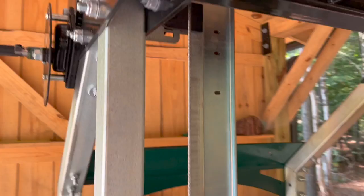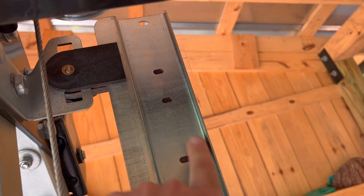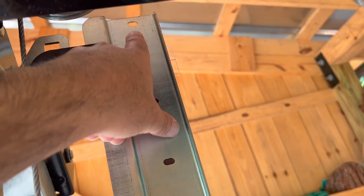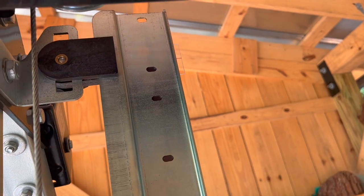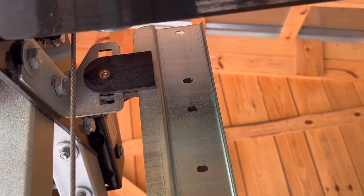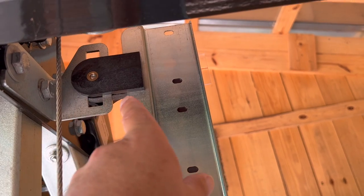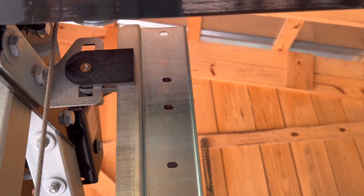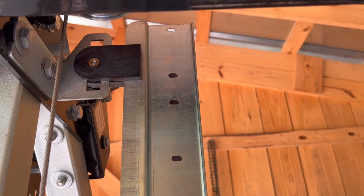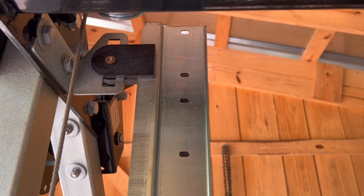And so what I decided to do is, let's go back around to this side, I'm going to mount the slide to the back side of this ruler rail. There's actually a hole up here at the top, and I'm going to use that hole and then drill another one down at the bottom, and I will mount the slide to this ruler rail, and then fabricate a bracket so that I can mount the DRO sensor to be fixed off of the same bracket used for the ruler pointer. And I think that's just going to be the quickest, easiest, and also take advantage of what's already here on the mill in terms of hardware to minimize what I need to do.